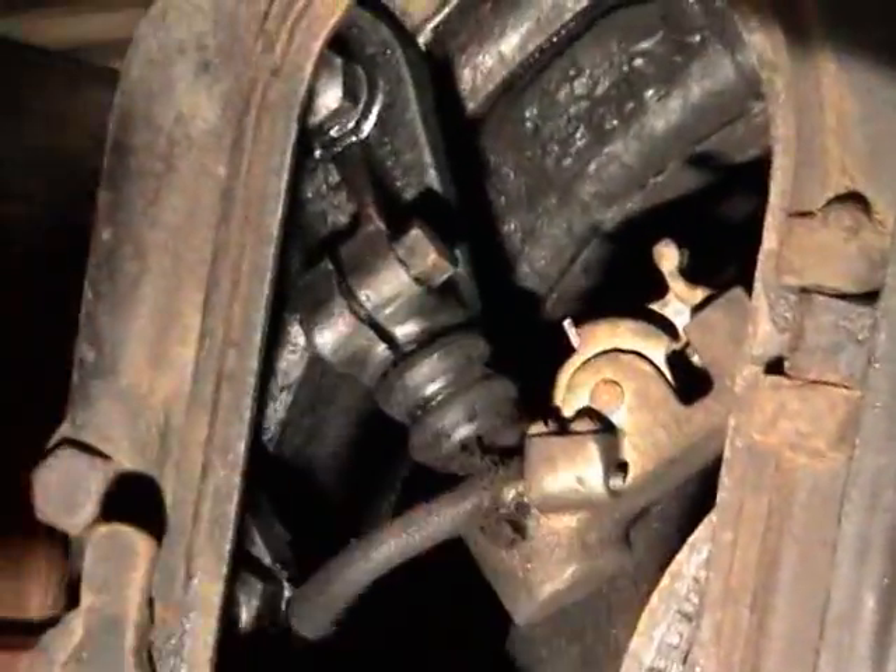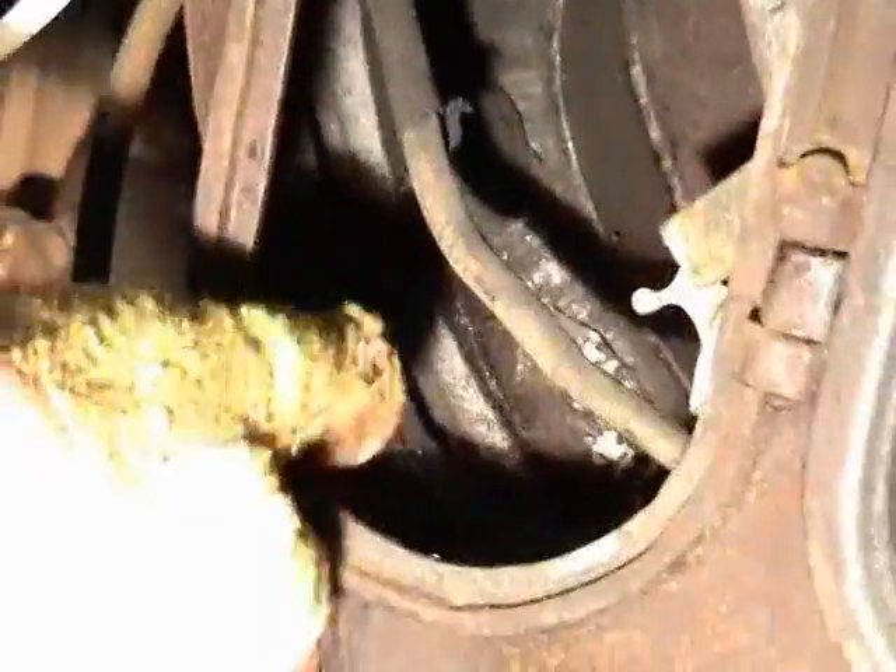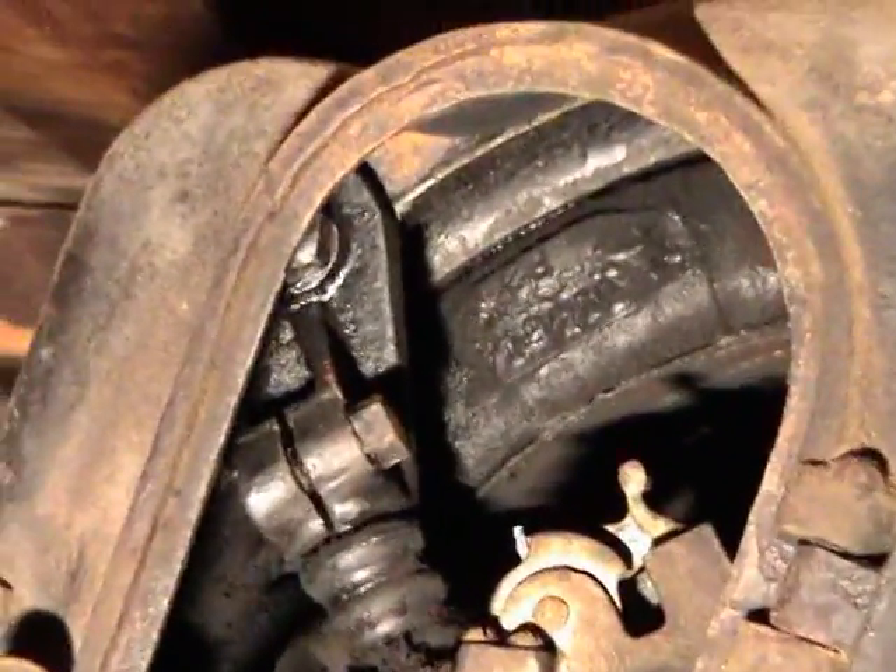You're looking at the commutator. I can't turn it by hand but it does turn around. These are brush holders — there's a carbon brush here and a carbon brush here, and electricity going into the armature, which is the part inside that turns around. On the outside you have four field coils, of which you can see two right there. Looking inside you can see the head of the compressor. There's the air pipe that comes out and feeds down to the reservoirs underneath, and the air strainer down near the floor, right there.